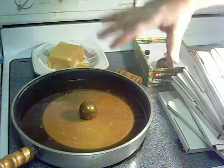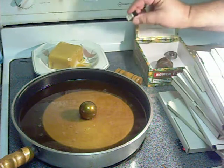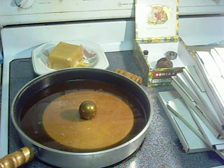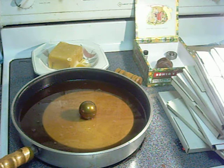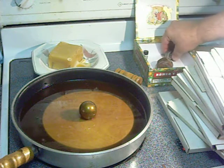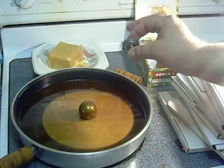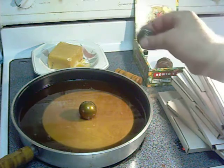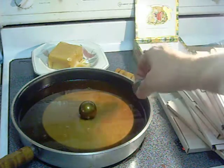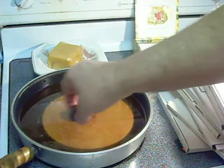When I'm done truing it up, I will take a quarter carat of 8000 mesh diamond powder and I will mix it with a little olive oil and I will spread it evenly with a small camel hair paintbrush around the surface of the lap. Then I will take a hardened roller — I get mine from old electric motors, that's hardened steel around the bearing surface — and I put a little piece of shaft through there and I roll that in really, really good, pushing that 8000 mesh evenly and nicely into the surface of the wax and the fibers of the wood.